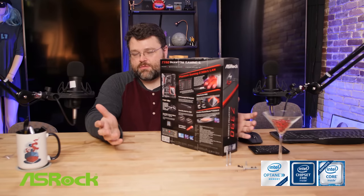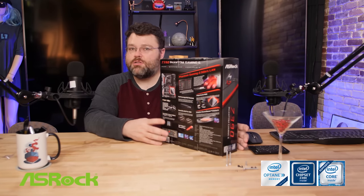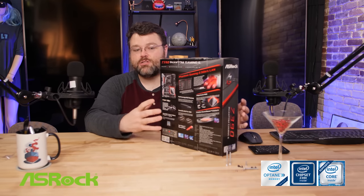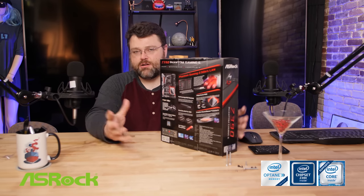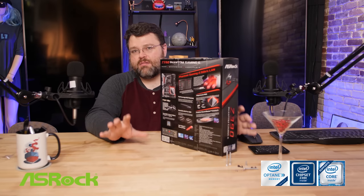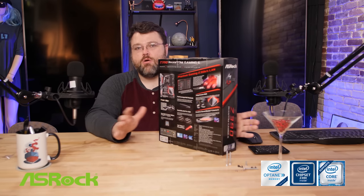This is a new chipset, the new Dragon 2.5 gigabit chipset. I've tested SMB multi-channel on this motherboard, and if you use both Ethernet adapters, you can actually transfer files from your multi-gigabit file share — your 10 gig file share or whatever — at over 300 megabytes per second, like 325, 330, something like that. Windows file share, no problem at all.